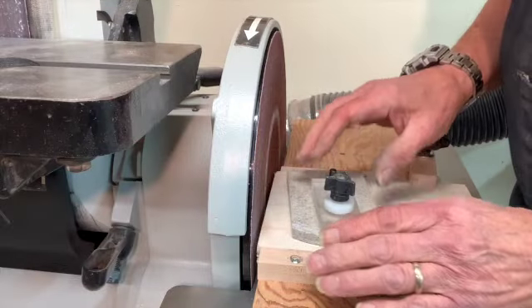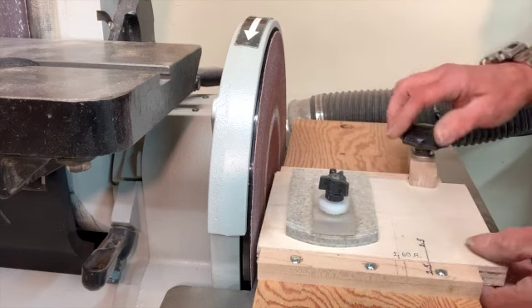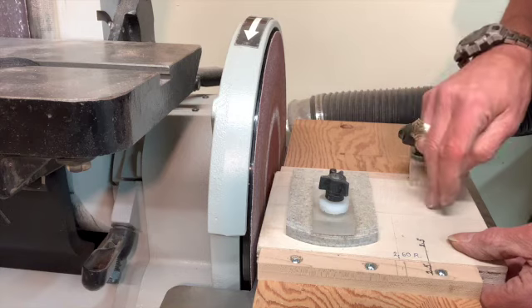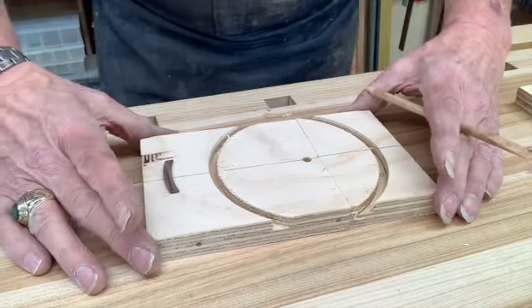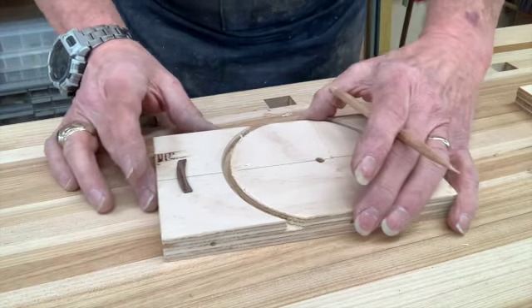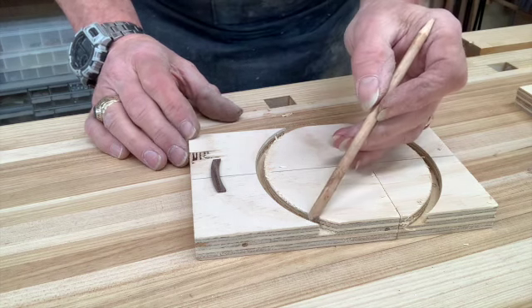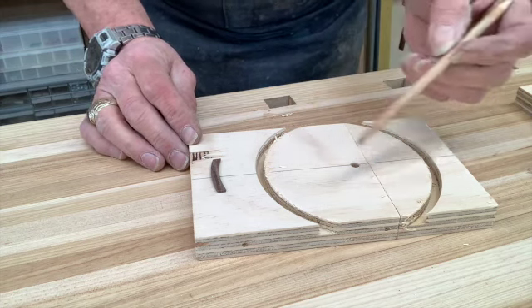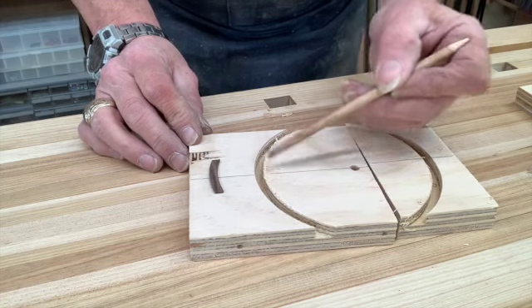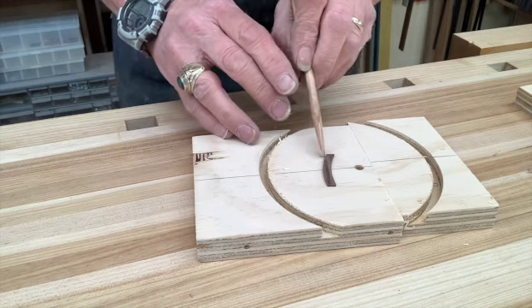This is very adjustable. The dimension between the center and the outer edge is absolutely critical, but you can tweak it a few thousandths of an inch by moving the platen. So this works really well. The last thing you'll need to do is make a circular miter box. Go back to your drill press and with your circle cutter in a scrap of plywood, cut a circle with the outside diameter matching the outside diameter of your tile.